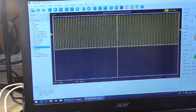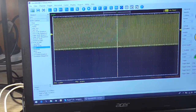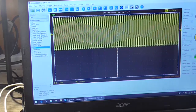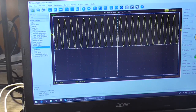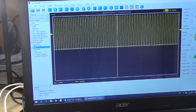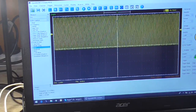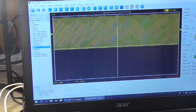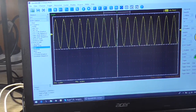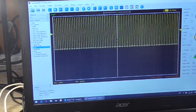I'm sorry if this video is going on longer than necessary, but I just wanted to make sure that I'm showing all the information that's relevant to this project, and just proving that my PCB version actually works a little bit better, actually a lot better, than the breadboard version. It proves a point that breadboard is not a good substrate for making a power amplifier on, because of all the wiring and the capacitance that's going to be added because of the way the breadboard is. It just adds extra capacitance to the circuit.